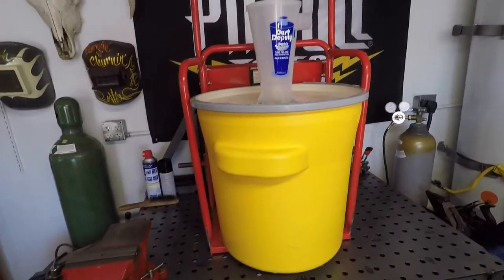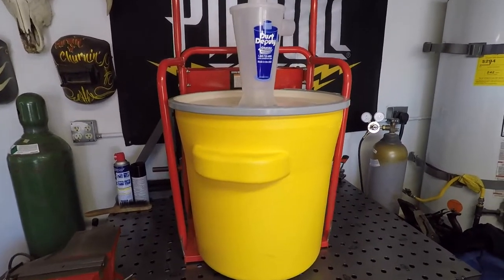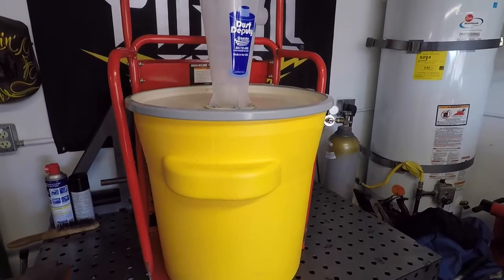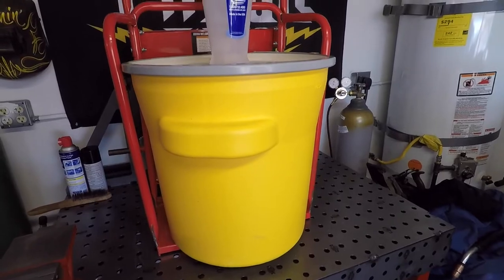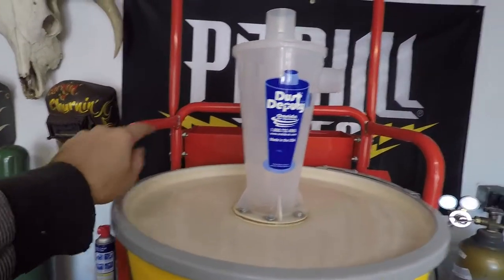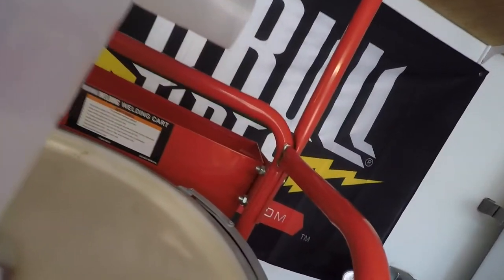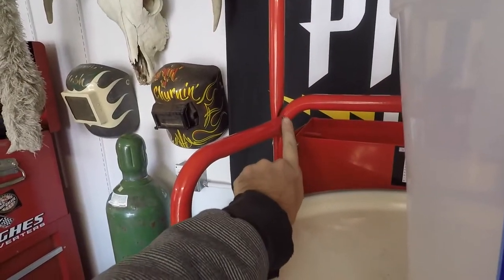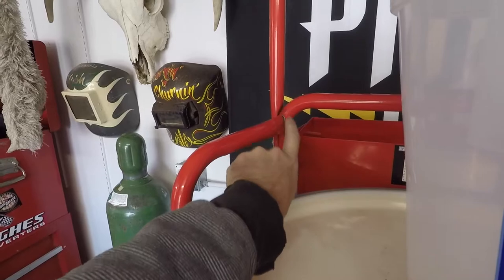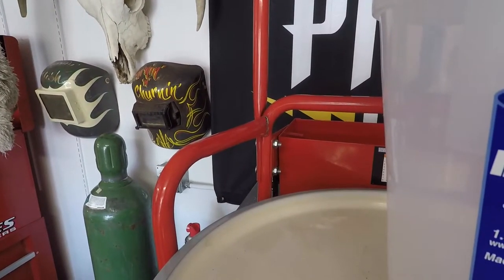The next step is going to be opening up the arms on the side to be able to fit your barrel. If you choose a different barrel you might not need to do this, but if you choose this one off of Amazon like I've linked in the description, you're going to need to make the side arms come out a little bit farther. I made a small slit right here and right there — just this side, from here down to here — so I could push it open a little bit and then weld it back in place later.